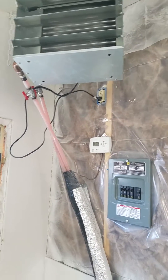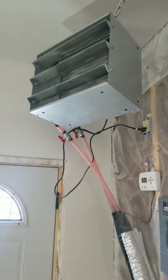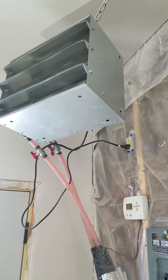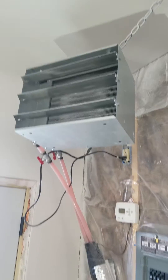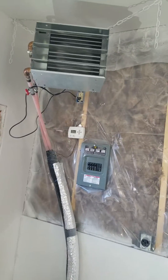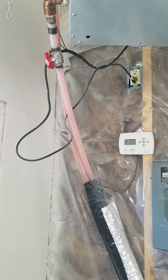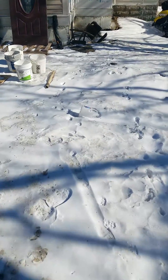The temperature drop isn't that much, so it's really not putting out 50,000 BTU — it's probably more like 25,000–30,000, which is what I've read from other reviews too. I would have upsized to a bigger model so it ran less, and I still might do that. But it works pretty good and puts out plenty of heat. I'm only losing a couple degrees running underground.